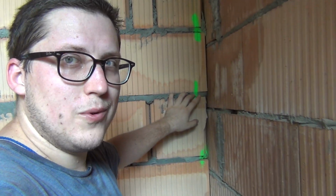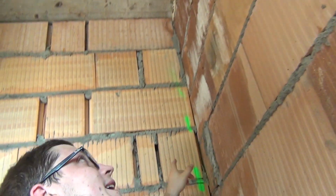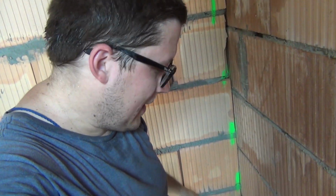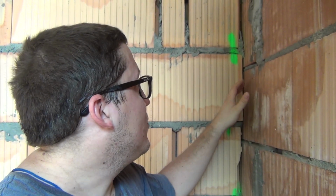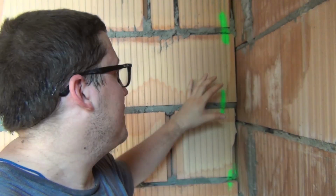What Mr. Powell has done is he put those rebar pieces from this wall into this wall, when the slab on the ceiling and the foundation both have a split between the two concrete, so the two buildings can shift. But with these rebar in place, when the two shift, this one is still tied to this, so the wall will crack somewhere, right? This wall will be moving in relation to this wall with the force of the whole building.